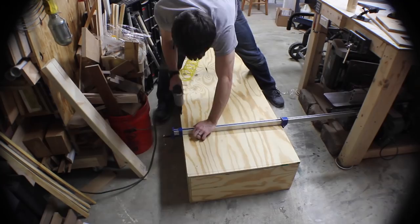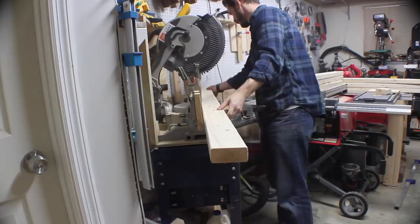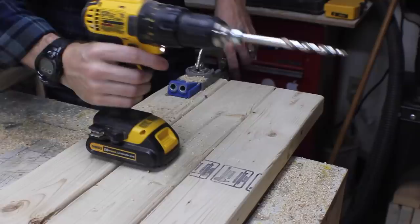And of course, I had to make two of these cabinets. The area between these two cabinets was just going to be filled with some 2x4 cross braces. I cut down several to length, and then used a pocket hole jig to drill two holes into the end of each piece. This takes a little while, but it's a pretty good joint, and it's definitely worth it.